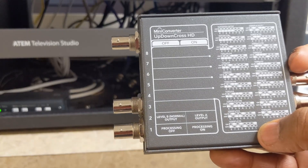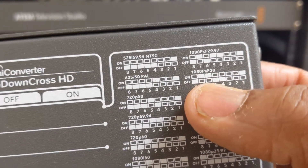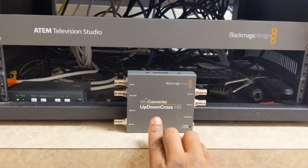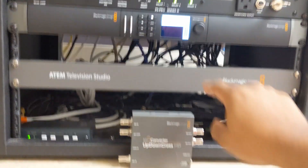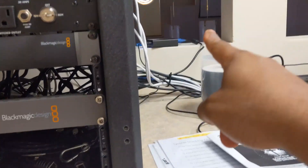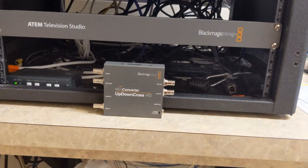I've already played with all the settings to find out which frame rate works. It's at 1080p at a specific frame rate that works for my projectors, and I already have it set. So the signal comes in, it bumps up to 1080p, then SDI out goes to the HyperDeck, another SDI out goes to our live streaming PC, and HDMI out goes to the regular output to convert it to VGA — because I don't have a lift to get up there and change the connection. Let me go ahead and hook that up.